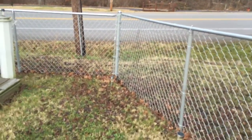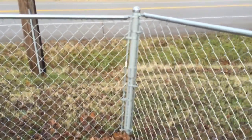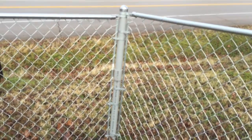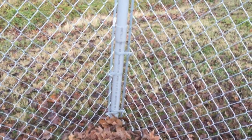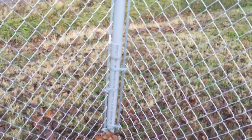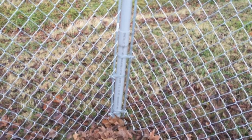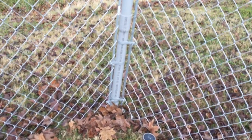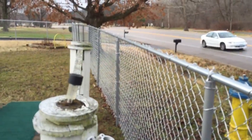On the corner post you do the same thing — on the two-inch pipe, cut six-foot sections and four-foot sections. In the four-foot section you have the swedge. You can see it's really strong — two foot in the barrel, drove in there with no concrete, just dropped it in and hit it with a sledge. On the line post, you just go all the way up.